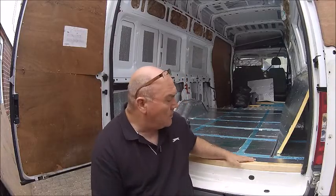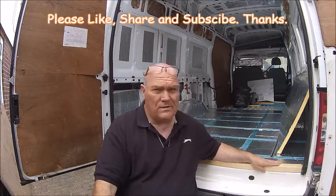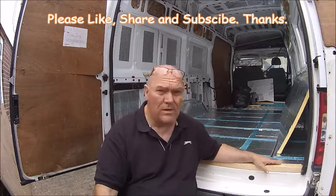Anyway, it's coming on. I just want to get the floor down, because the other reason I wanted to get the floor in was to give me a true indication — once the floor is applied — as to my height. Because I've got a decision to make about the ceiling, which is whether I go for 50mm insulation or 25mm. And that's dependent on whether I put ceiling battens underneath the metal ridges or on the side of the metal ridges. If you put them on the side of the metal ridges, you lose the insulation, but if you put them underneath the metal ridges, you lose height. I'm trying to decide that as well. Anyway, onwards and upwards, let's crack on.